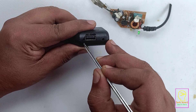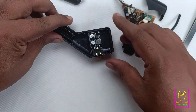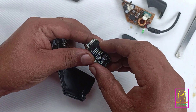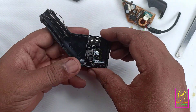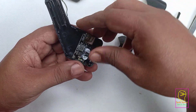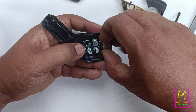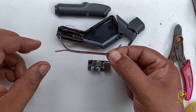If you want the edges to be perfect you can fill the area using a glue stick or something similar. I haven't fixed the broken enclosure yet because we still need to solder the wires from the terminals to the charging module. I am planning to fix the charging module in this position — for that I have ground a bit on one side of the PCB and also a small portion on the other side. Now you can fit the charging module in between the enclosure edges. The advantage is you don't need to glue it, and when you push the cable into the USB port the module will not move inside, and when you pull out the cable nothing will happen to the module either.